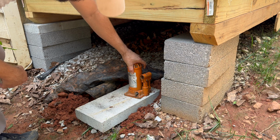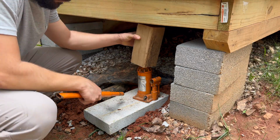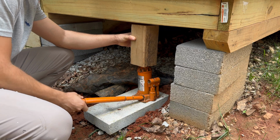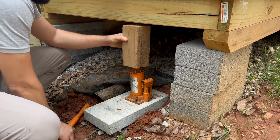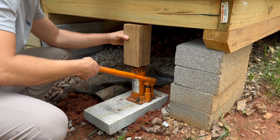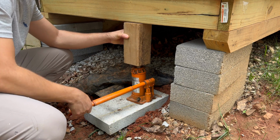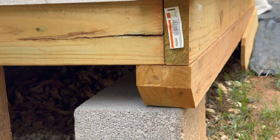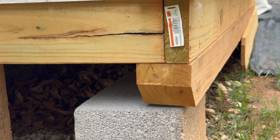Ideally, you want to lift the shed from the 4x4 skids. But if you're working on the skids, you need some room to move. So I recommend finding the closest joist near the skid and placing a jack underneath. Depending on your shed, you may actually need to cut a small piece of blocking to help the jack reach the joist and lift it properly.